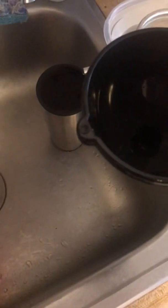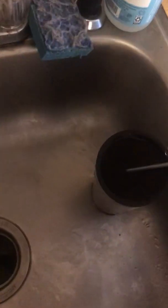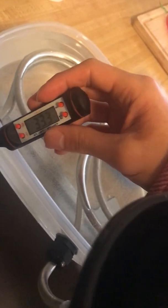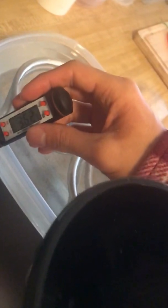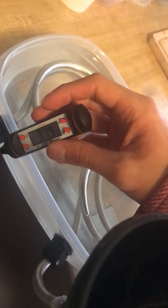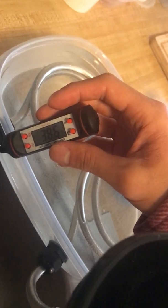Another thing I learned was that when you pass a liquid through it very quickly, you're not really taking advantage of all the possible heat transfer you can get, just because the time that it's in the heat exchanger is a lot shorter. While there may be a higher rate of heat transfer due to the increased speed of the fluid, the fact that there's not enough time for the heat to pass from one body to the other means that less heat is transferred, even though the rate is higher.